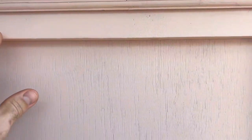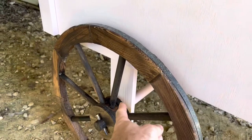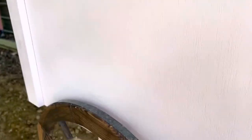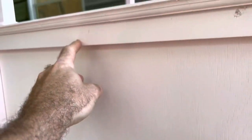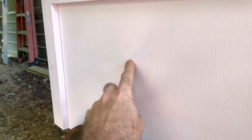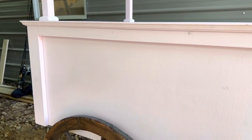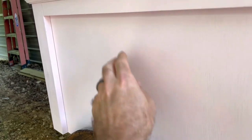The same goes for the top when you're screwing your legs on for the wheels — you want to put the screws behind the trim piece. I actually didn't do that and I had some screws showing right there; you can just barely see them. If you're backed away you can hardly see them at all, but I kind of messed up on this one, so just remember to cover the screw holes.